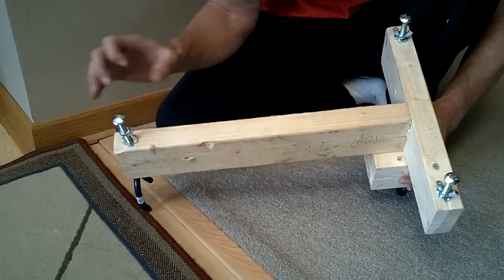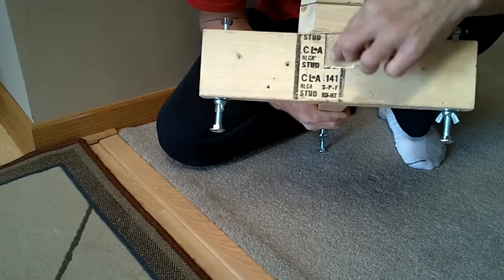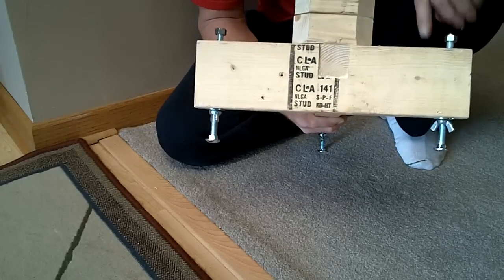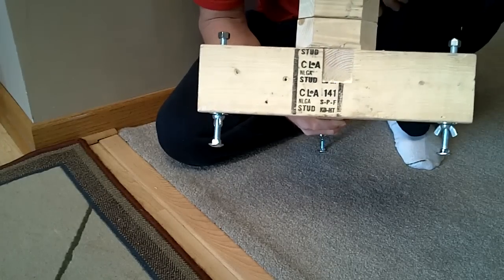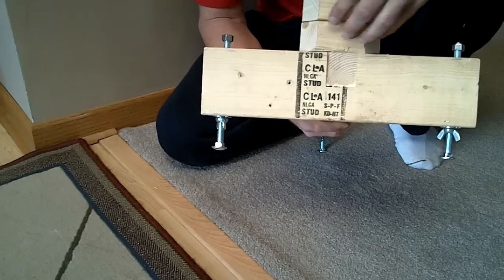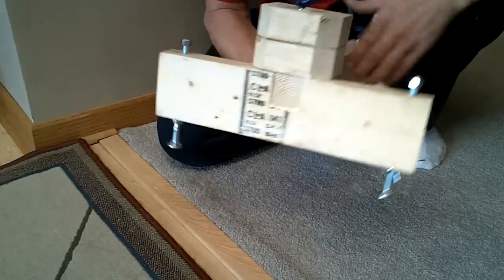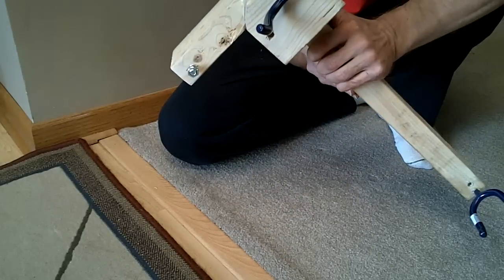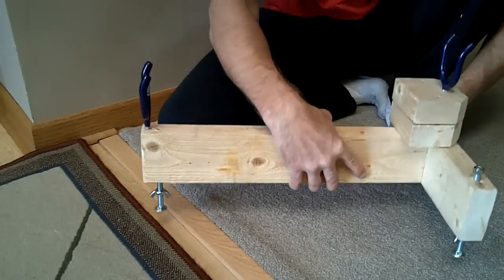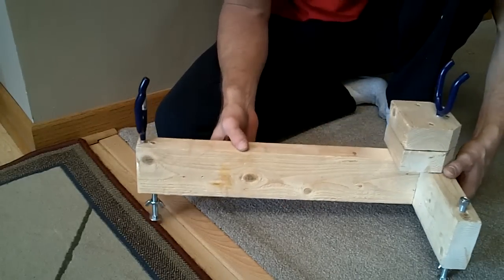After that, as far as the construction of the wood, you can see I just notched out the 2x4 here, notched out both sides, this one and the other one, and recessed a couple sheetrock screws down there and glued it. Same with these two pieces. They're just placed on top of one another, glued and screwed down by 3 screws in the top. You kind of see how that goes. It's amazingly sturdy. It's easily adjusted, height, front or back.